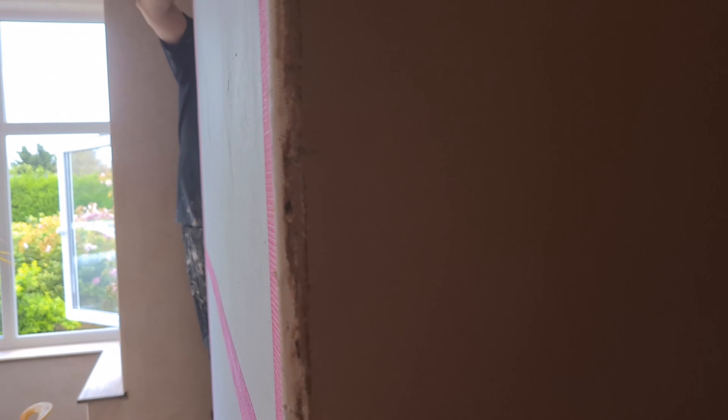I let it go off a bit longer than normal. I've put the second coat on and that allows me to get a nice perfect finish along there without anything built up. I haven't flatted that yet but it's going to go really nicely. You can put it on too thick or too thin and you'll end up trying to trowel it forever, but I'd rather it be slightly over-dry on this edge — when you flat it with your trowel you can work it in and get it nice and smooth.